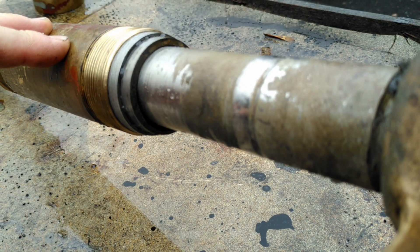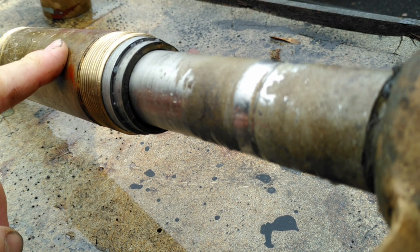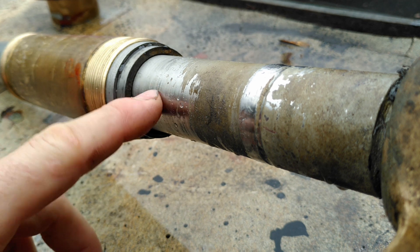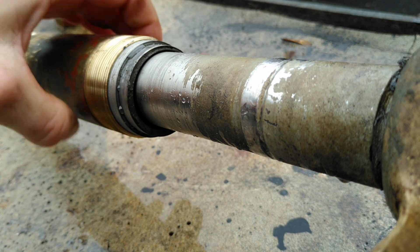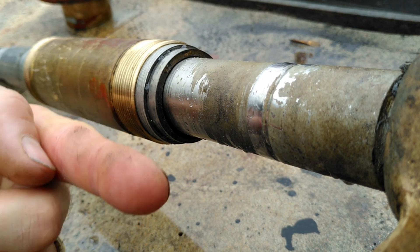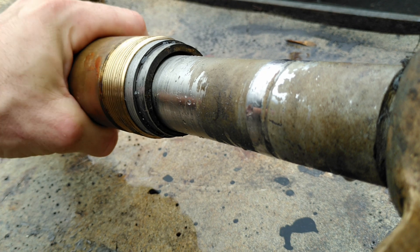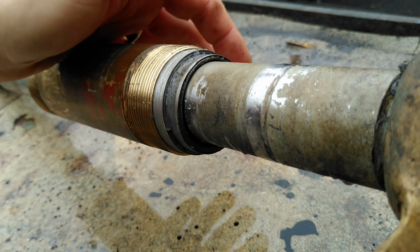This equipment was installed on a Mitsubishi Thornycroft but also had a python drive and a thrust bearing. The thrust bearing is okay, so that equipment has saved the gearbox and that sort of thing, but unfortunately this is just age. What happens with this is the propeller will literally be shaking around and hammering. You can imagine the shaft is doing what I'm demonstrating with this. So this is beyond acceptable tolerances in terms of the wear.